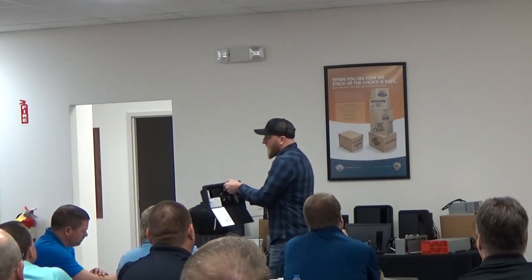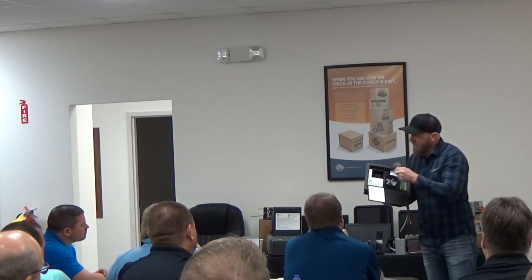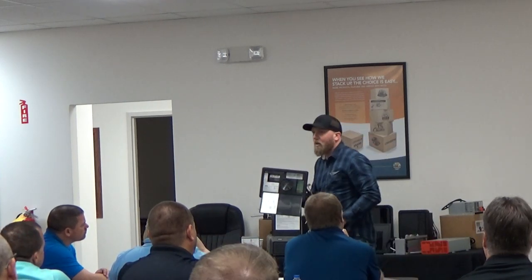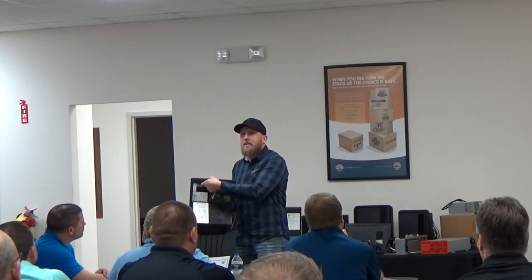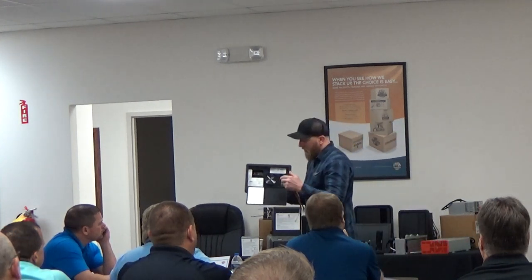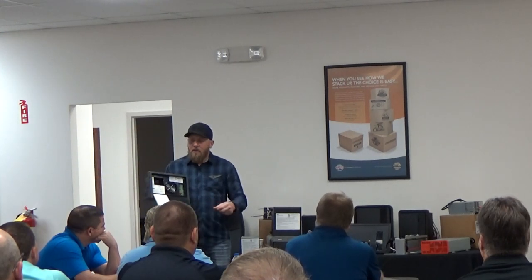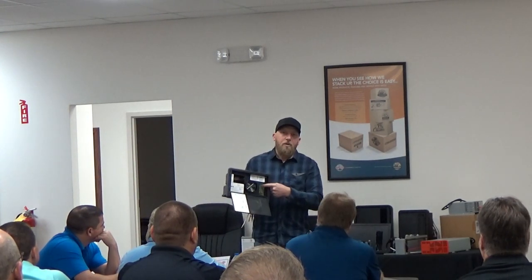The 8725 and 12 are just like this, but they are not zero clearance. There's not a huge market on the 12 and 25, just because if I was to take these out, the 8735 and 40 have three stabs on your AC side. So you have three stabs that you put breakers on. And you can use single breakers or double breakers, so you could technically have six AC circuits on this one. And on the DC feed board, you have six DC circuits. The 8725 and 12, you only have two stabs and four DC circuits.